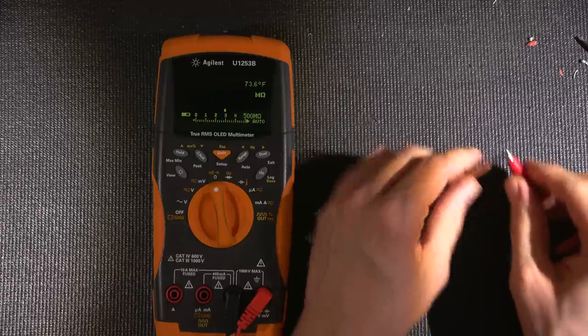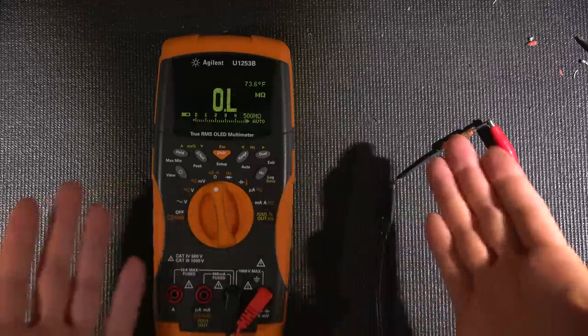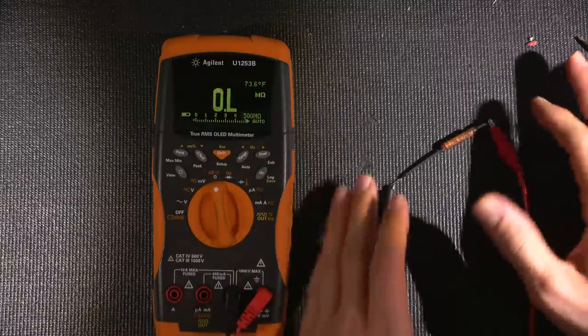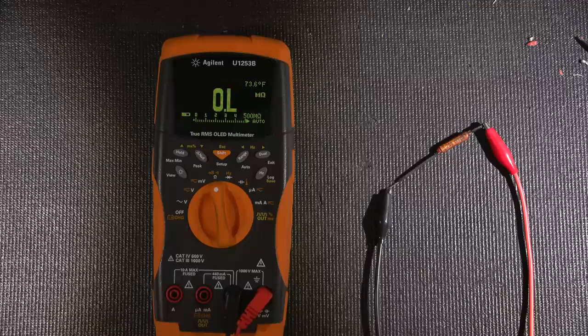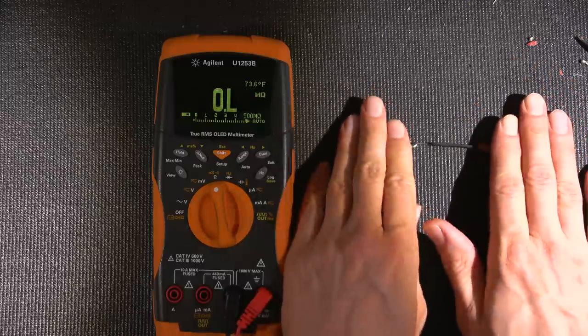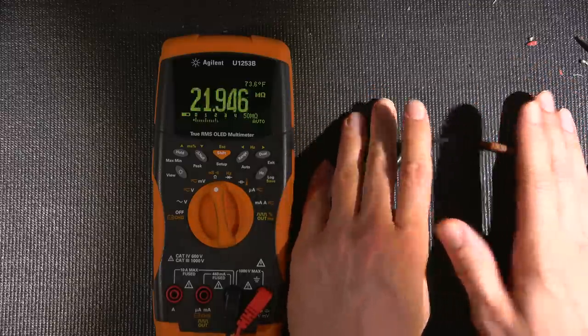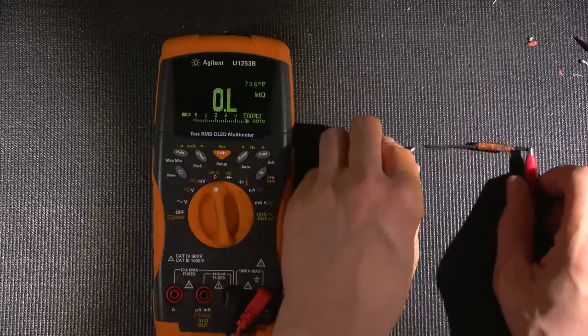Okay. That's me touching it. So when I touched it here, I grounded it out. So you can see this here is very sensitive at 500 megohms. It's going to take a little while for it to go up there. Even just moving the leads around will cause a shift, because 500 megohms is way up there, half a gig ohm. Okay, so as you can see, this is reading above 500 megohms. So you're thinking, wow, that's hardly any leakage resistance, right?